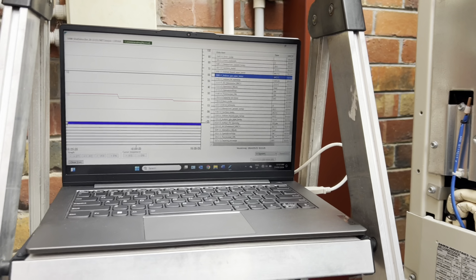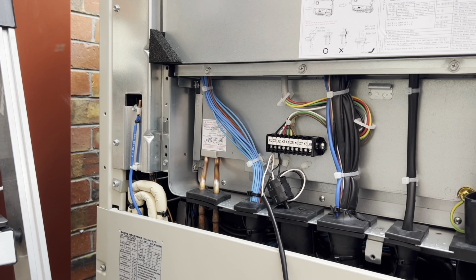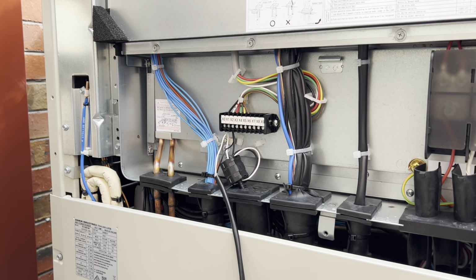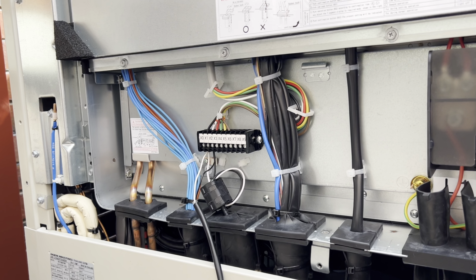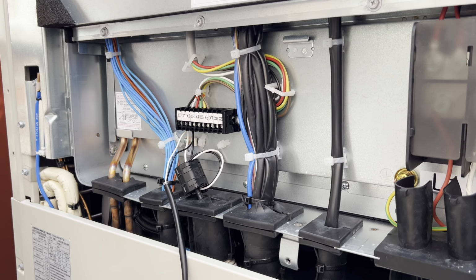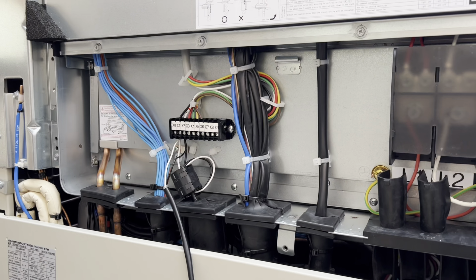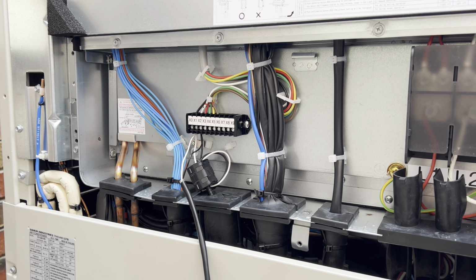That's nice. Easy. All right, we'll get this thing running. Probably have to turn them all to cool mode so we can charge up. It only needs an additional 1 kilo, so not too much. That'll obviously change once they put on the additional 3 heads, but that is not for today's problem. That is a problem for another day.